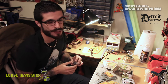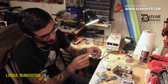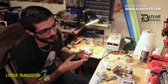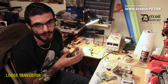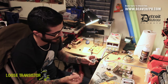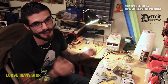The drawback — and why I say this board is a little difficult to wire — is because it requires you to wire the battery positive and battery negative to the FC, then run a positive lead out of the FC onto your PDB and also a ground lead from the FC to the PDB, so they're essentially in parallel. This is just so you can get current reading, voltage, and also power the FC. I don't understand why they just didn't make this a full AIO with a PDB part for soldering the ESCs, but whatever — it's still a great board and it flies awesome. It also has a nice SD card you can use for your black box, so you can have gigabytes of flight logs.